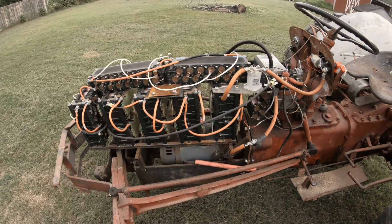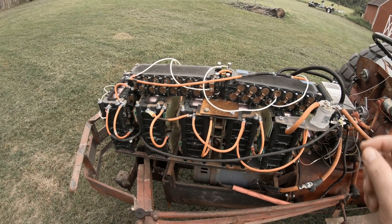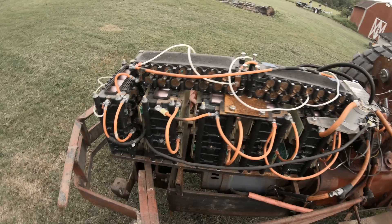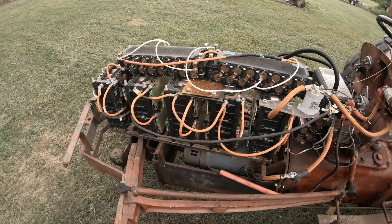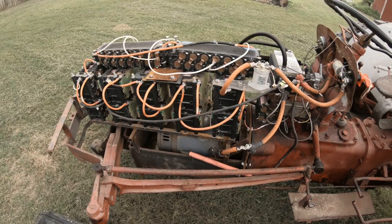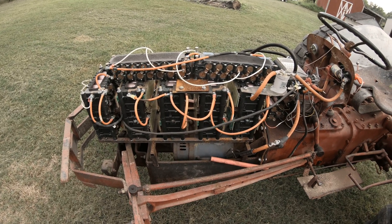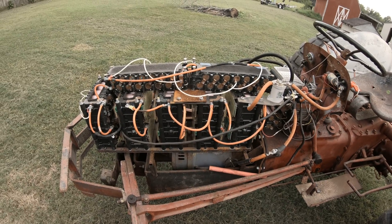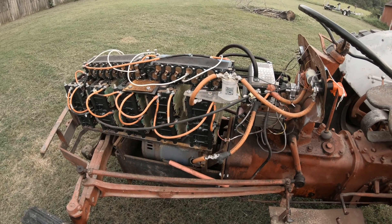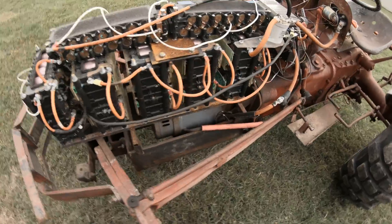I do not have a battery management system on this tractor, and I've already started to see a pretty big variance in the cells. There's not an easy way to just tie them all together because cell-to-cell voltage can vary based on corrosion. Would I do it again with these batteries? Because I had them for free, yes. But if I plan to keep the structure for a while, these are probably not going to be the long-term batteries. I'm probably going to move to a setup with fewer cells — maybe some lithium iron phosphate cells, the 3.2V 280Ah large cells — which would be a better match for this.